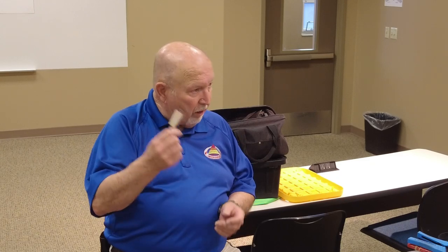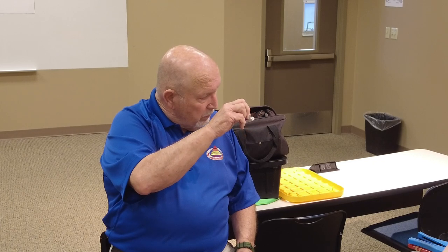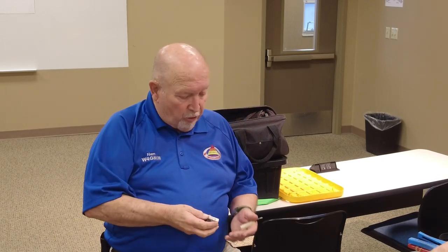And this is not my design. This is Astron's design. This is exactly how the battery backup in the Astron power supply is done. It's done on one of these, like there. And like I say, you can put whatever size resistor you want here, depending upon what charge current you want going into your battery.